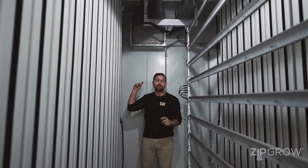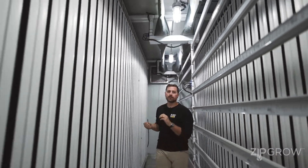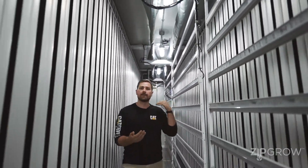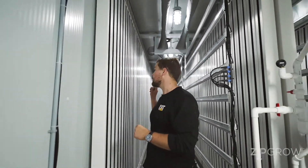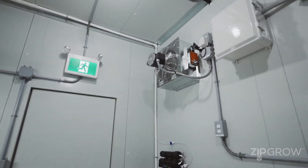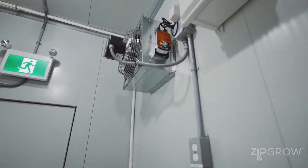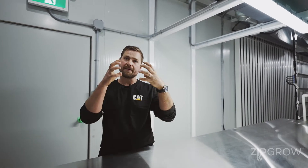Overhead, we've got a fresh air louvered intake with a filter. This unit is used in the case of high CO2 or dangerous gas in your environment — it will open in pair with the exhaust fan at the front, which will push the air out. Fresh air comes in the back, and this unit and the one in the rear are thermally sealed from the exterior to prevent any freezing of louvers in extreme temperature environments.